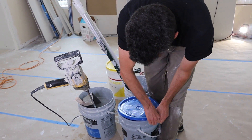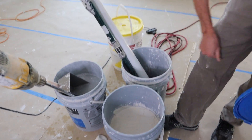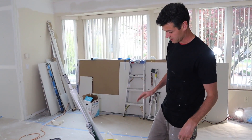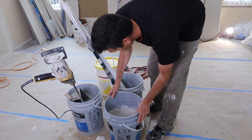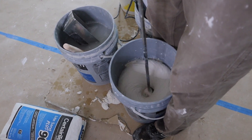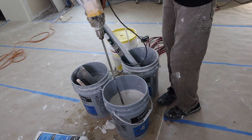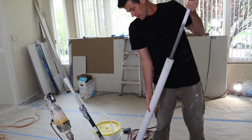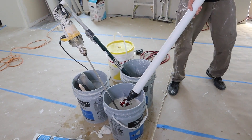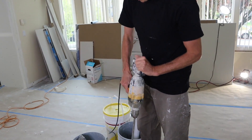Well, I'm finally ready to start on the corners again. We'll get into this bucket of mud — it hasn't been open for a couple of weeks. Oh, it's not too bad. So first thing is the consistency you want for corners, and that is loose. This is definitely going to be too thick. Looks like the last time I used it was for skimming, so it's pretty wet but nowhere near how we want it yet. We're going to add a fair bit of water to this — it's more about what it does after we mix it. We're looking for that big nuclear explosion in the bucket — that's what we want for corner coating mud.